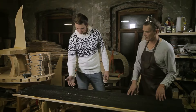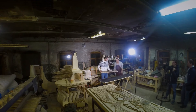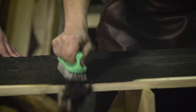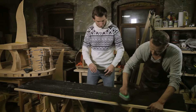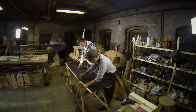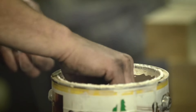The only disadvantage is, of course, that the house will smut a bit. To use untreated burned wood is the original idea behind this Japanese technology. But today, with the appearance of chemical methods of protection, the charred upper layer may be easily removed with the help of a usual brush. Of course, you shouldn't do it indoors. You can cover the wood with lacquer or paint if you like — the color will be really unusual.